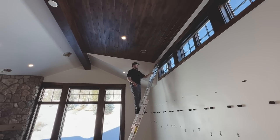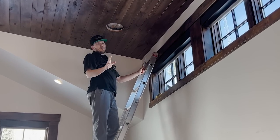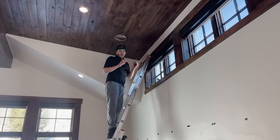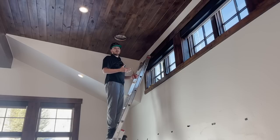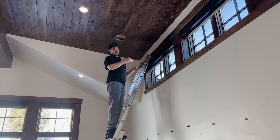I just checked stud placement and I'm going to cut a test hole here — it needs to be big enough for me to fit my big hammer drill up in there to drill through the framing. Pro tip: when you're cutting holes, it doesn't matter how big you make the hole — it's still going to be just as difficult to patch, whether it's tiny or giant, because the whole wall has to be repainted to match. So don't feel overly intrusive by cutting a big hole; it'll just make your job easier getting through the thick framing.